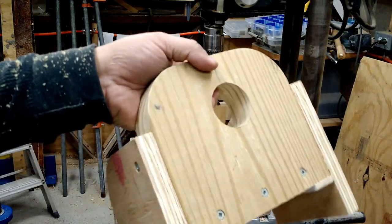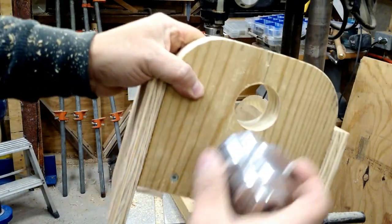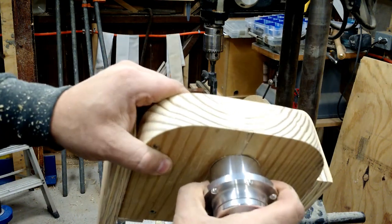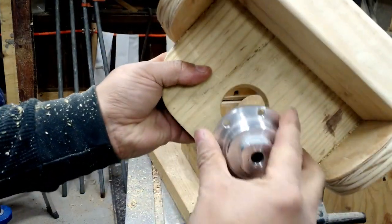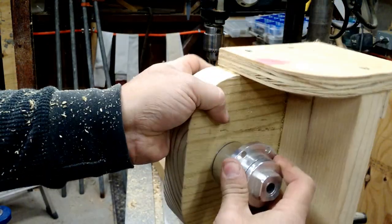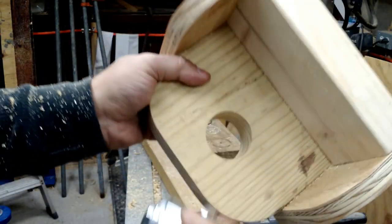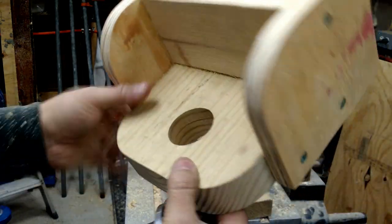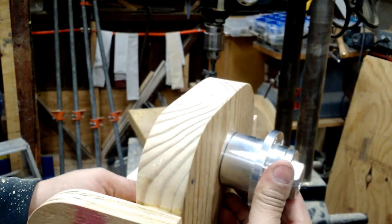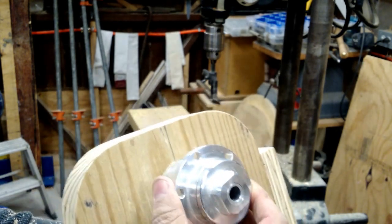Okay, so I've got the hole in there. As you saw, I went from both sides because the bit is not long enough, and you can see it's a little bit under — it just will just start. So that gives me enough room to go ahead and sand it. I will just put it in the spindle sander and gently clean that up until this is a tap-in fit. And that will basically finish the tailstock. I just have to put in a center.